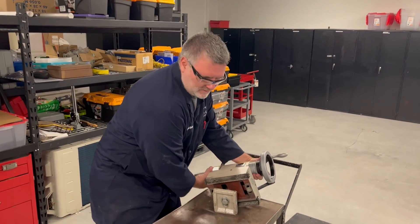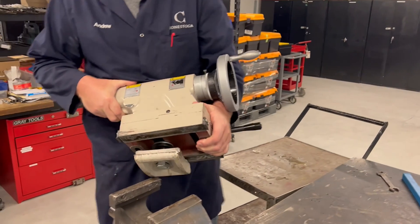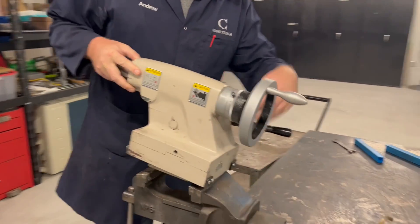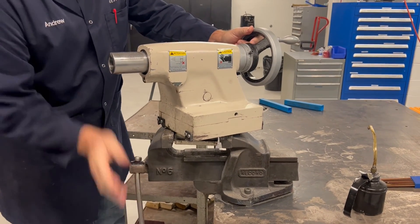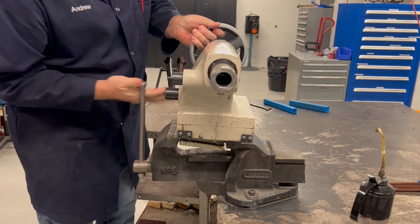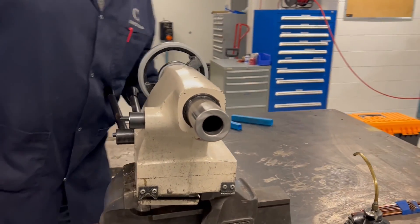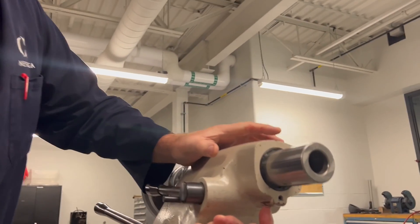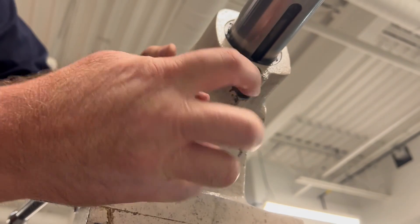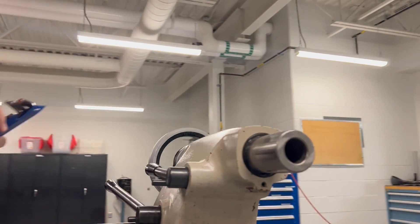The plan is to get this tail stock apart. I'm going to put it up in the vise — it's a bit of a beast, quite a big one. It's secured so it doesn't end up on the floor. How this is retained is we have a keyed dowel that slips in from the bottom, and then a retaining set screw to hold that keyed dowel in place.